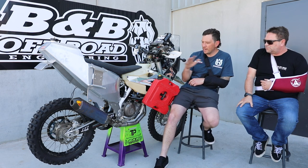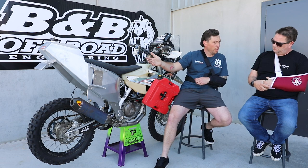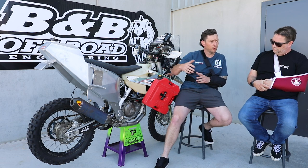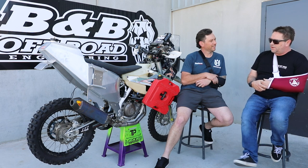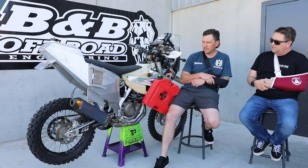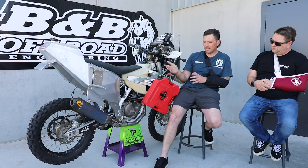The weight is only 50 kilos in the rear with fuel, which is amazing, because that's what a normal bike would have anyway if you just had a normal subframe — by the time you've put on three or four bladders you'd be up to the 50 kilo mark. I was pretty happy with the dry weight at 13 kilos — I thought it would have been 20 but it came out at 13. To be able to get 34 to 35 litres of fuel in the rear is amazing.